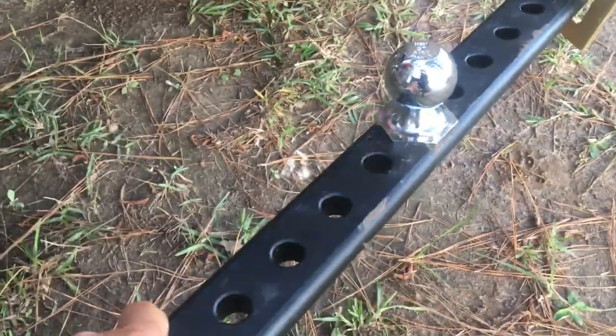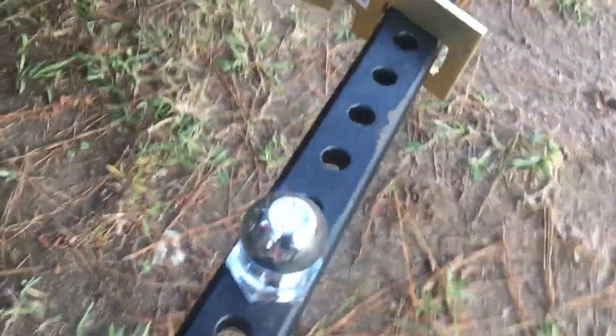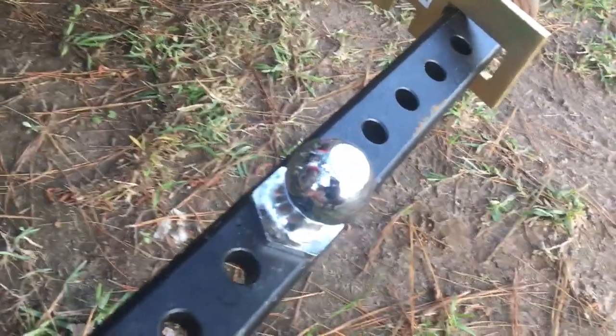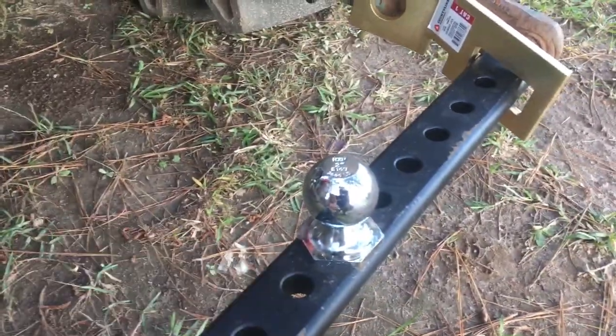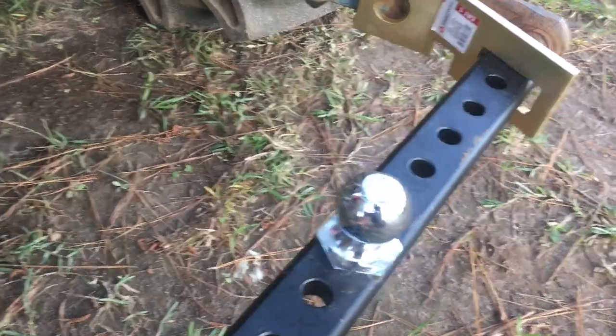One issue of course is that because of this it would just rock, but as you can see, that lock is formed for the drawbar to fit in and then it comes around. There are a couple different places you can pin it — we just pin it in this one because we use it around the yard. As sloppy as that looks, it's actually quite perfect because as we use the lifting arms on the tractor to go up underneath the trailer, pick it up, and take it away, there's a little movement allowed there.